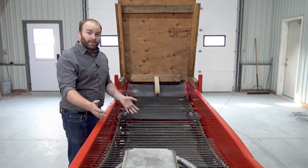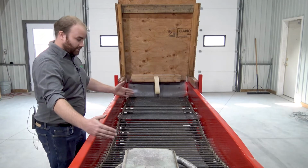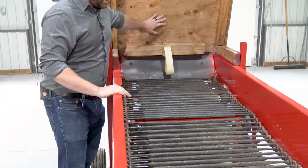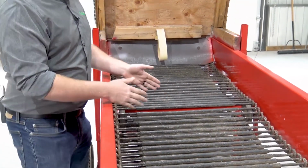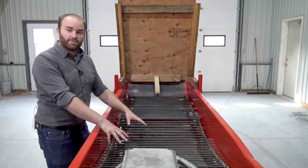So on our conveyor here, one of the best spots we decided to put the load cells is in between this section. We're away from where the product comes out. The product comes along, has a little bit of time to settle and not roll and bounce around. And then we have a few feet of nice flat section which we can take some rollers out and put in the load cells.